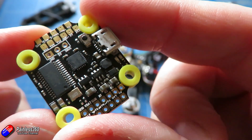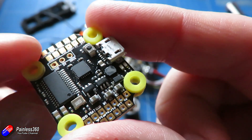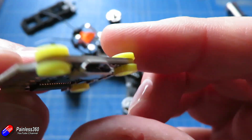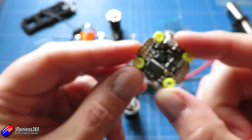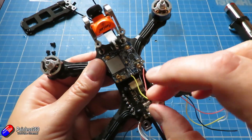I've spent a little bit of time figuring out how everything is going to go together. This Gecko is quite cool because even though it's very small and compact it actually has two separate stacks - one for the two millimeter bolts at the front that's going to hold the Runcam Split, and a standard 20 millimeter, three millimeter bolt layout at the back for the mini flight controllers and also the 4-in-1 ESC.